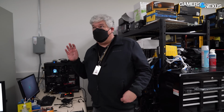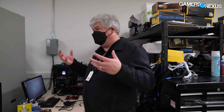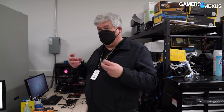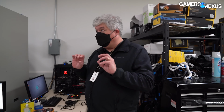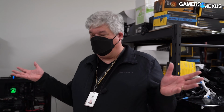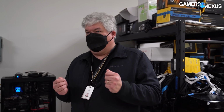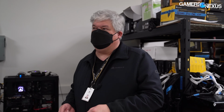For a higher wattage, you want full bridge because at higher wattage there's obviously more power. It's creating more heat and everything like that. You want to dissipate that across as many components as possible. So full bridge is good for 1200 watt, 1500 watt, 1800 watt, whatever. If you have a 750 watt and it's full bridge, you actually have to be suspect, because you're putting twice as many components in there when it's not supposed to be generating that much heat.